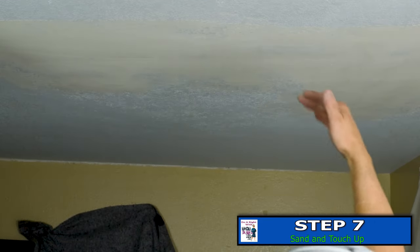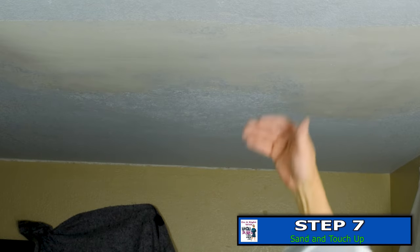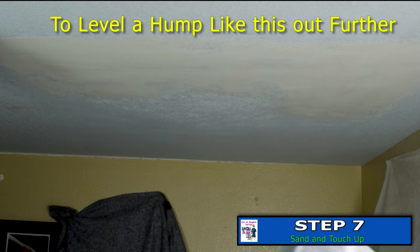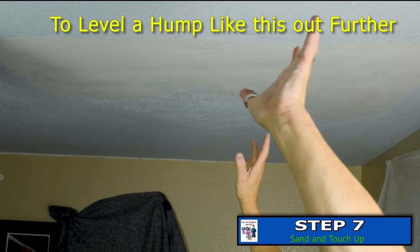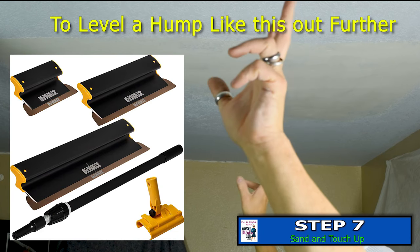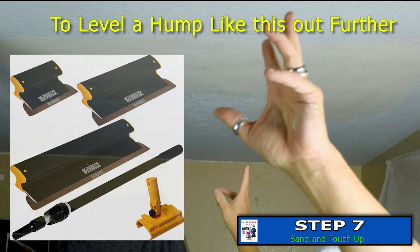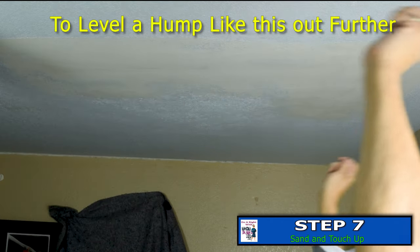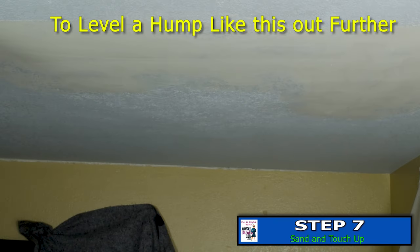You can see it's still got that wavy spot there — once this is all done that won't be seen. If you really wanted to level all of that out, you could skim coat it with a pretty heavy skim coat and then use a skim coat blade, which you can get in two-foot and three-foot lengths. Run that over it and it would level it out — I'll put a link to one in the description.